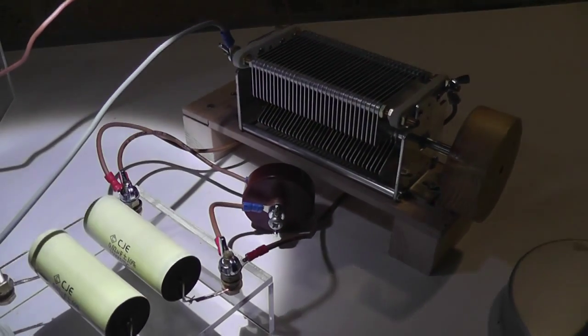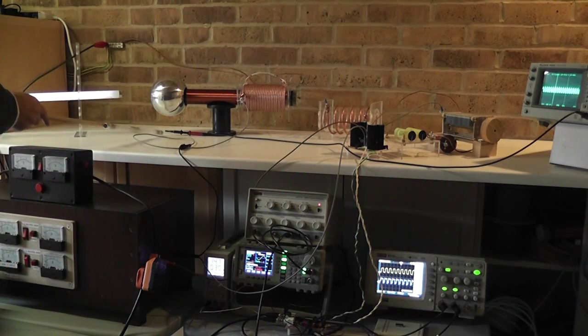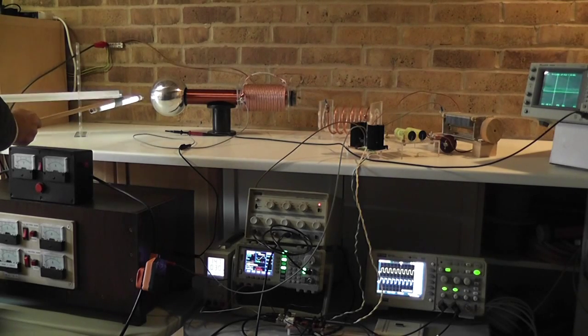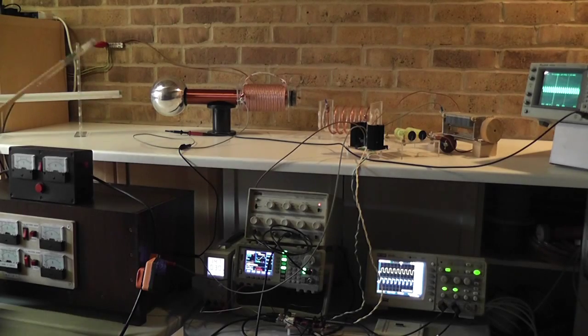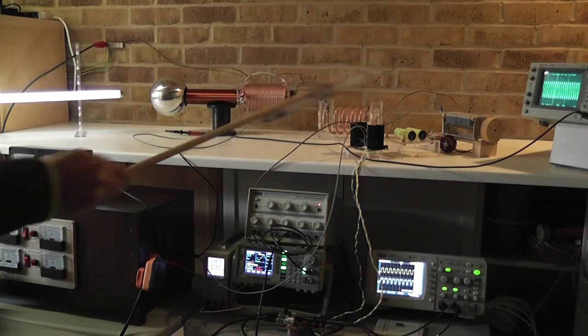And then you will see that has a huge impact. I have started my setup now, optimized for highest frequency and lowest current. At the moment it's at around 20-30 volt. On the oscilloscope I have 86 volt measured here with this probe. And as you can see, when I got that, it's actually reducing and the current goes down to zero. Let's bring it up a bit — at the moment I have 50 volt and on the oscilloscope it is 310 volt.